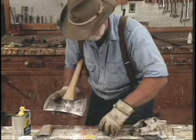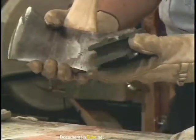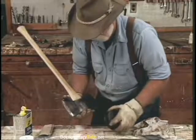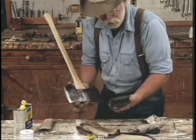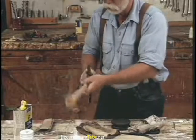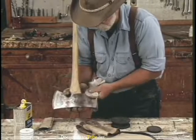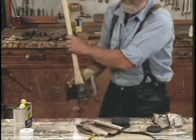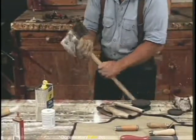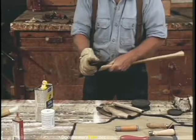When you're finished with the coarse side and you do this side, then you flip it over and do the other side. As soon as you feel a wire edge, then you go to the fine side of the stone and do the same thing on both sides. You go from one side to the other and push the wire edge back and forth until it's real, real thin. Then what I do is strop it — a piece of wood will work pretty good. Just draw it, strop the wire edge one side to the other across a piece of wood, and it'll break the wire edge off.